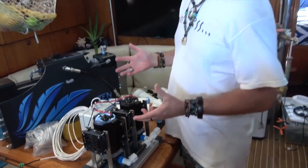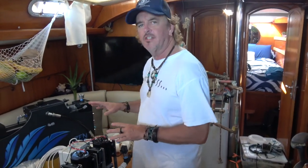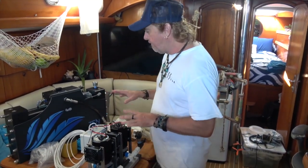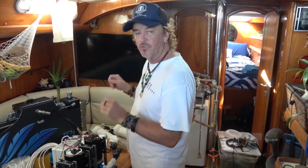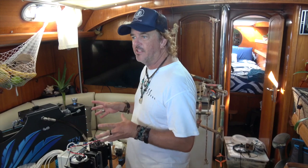You can get water makers for around two thousand dollars, but this one is around six thousand. When you look at the long-term benefits of a high efficiency machine, you don't need a generator. If you don't already have one, you're looking at at least two thousand dollars for a generator capable of powering a suitably sized water maker. The average water maker this size draws in excess of 100 to 120 amps at 12 volts DC.